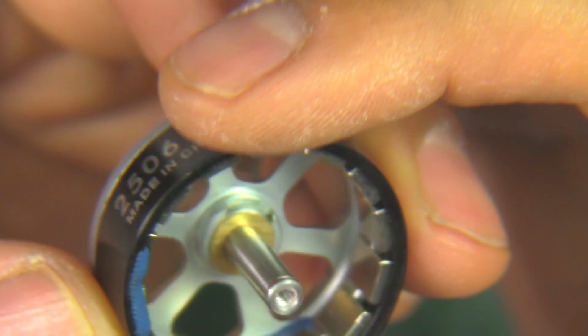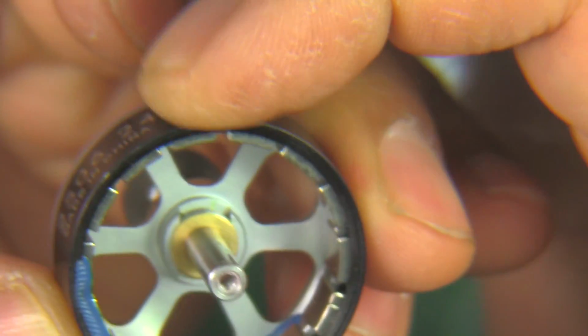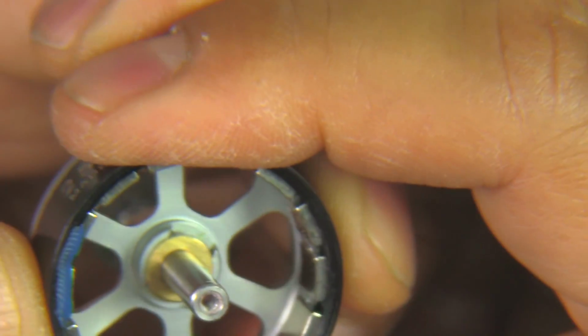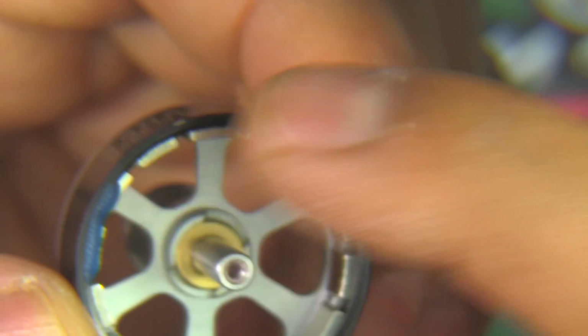Any round metal ring, if you compress it, it'll easily deform. But if you add a lip, it's going to be stronger. That's why the fenders on your car, if you touch under the fender, it'll also have a lip, so that adds strength.